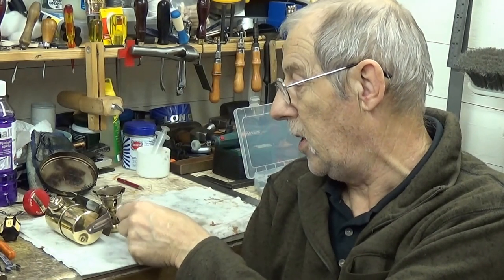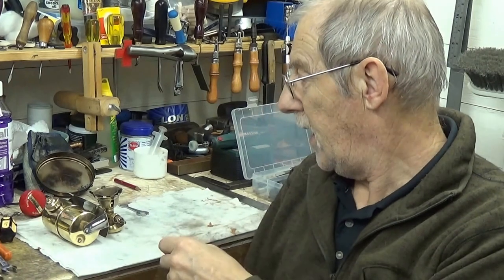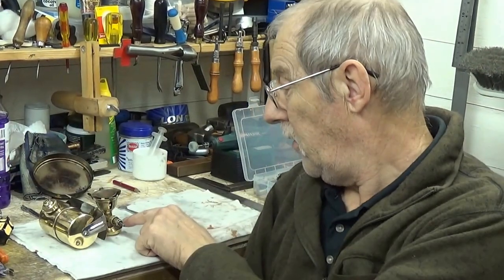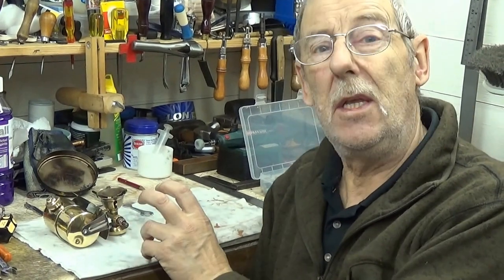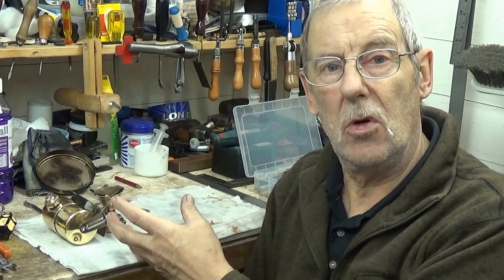I put some meths in this bowl and once it was turned off — which is to the right — I primed it. A lot of people are impatient: they put fluid in, squirt this open, get some fluid in there, put a match to it and it flames up like crazy, and as soon as they've done that they straight away grab the key and start turning it. Well they've not given it time to prime — it's got to warm up the shaft to vaporize the fuel. I filled that up twice: the second time I put it in there and let it burn out, then I got my lighter, just cracked it open on this thing, put the lighter to it and it was going straight away. If it's going, leave it — just for a minute or two. It soon heats up around the tube to vaporize the fuel, and suddenly she's roaring like a good one. There is a correct way to prime and light them, and you won't have a problem.